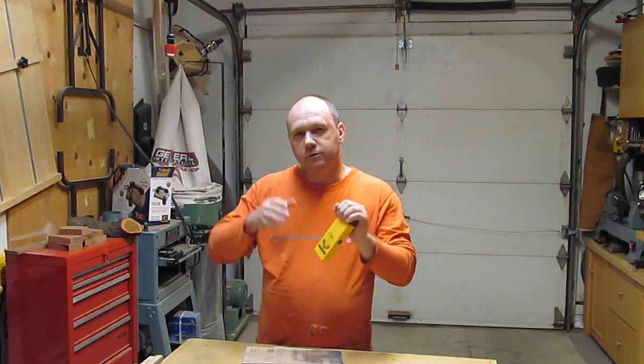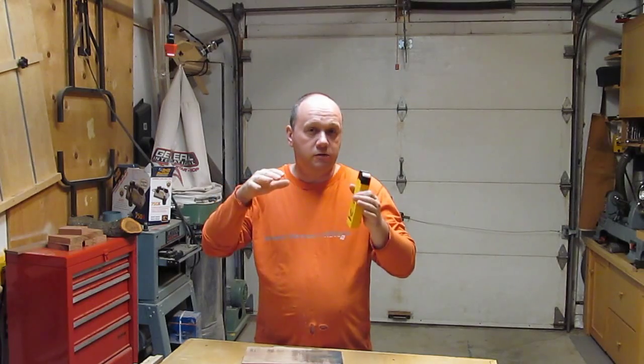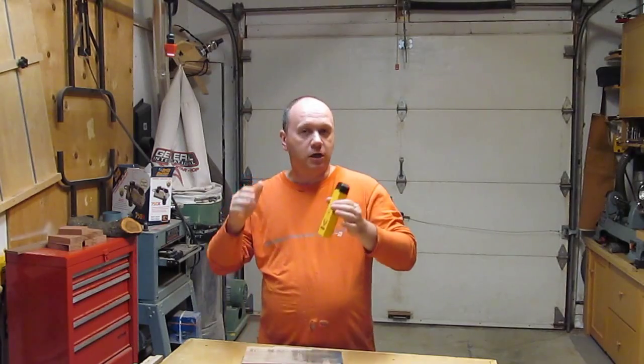When you put your wood outside, if it's not dry it will stabilize around 12%, not lower than that. I store my wood in my shed — I made some openings to have air pass by, and it's protected from water and snow.